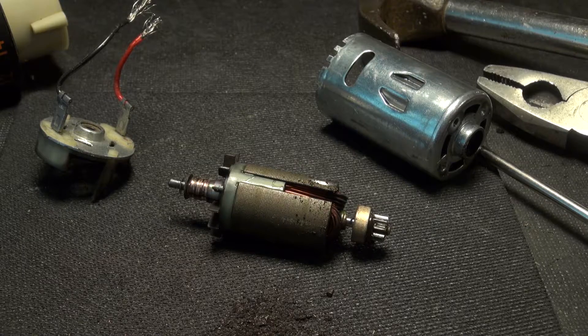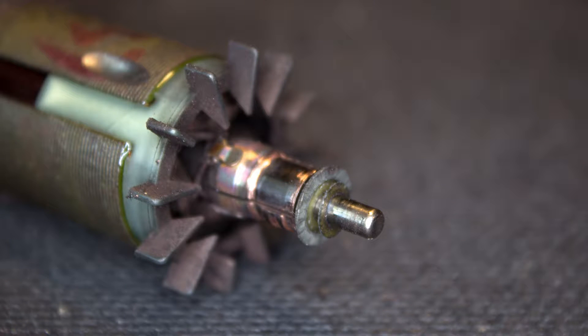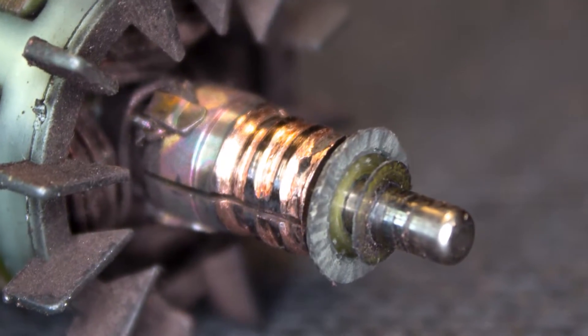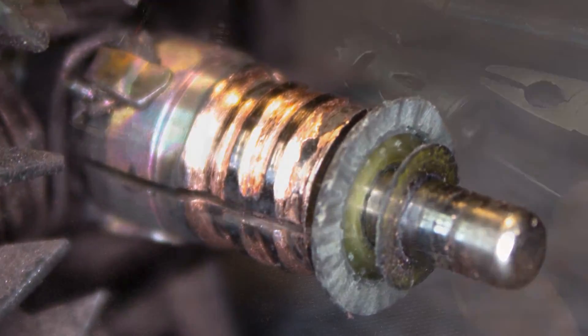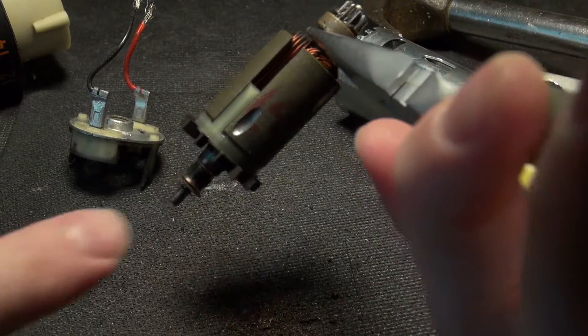Hard to get two brushes — that's a definite negative. The commutator has definitely seen better days; it is pretty gross looking and really worn out, especially on one half side which looks pretty shot. The fan at least — I'd say that's probably metal with balancing marks, pretty deep, one in the back and one in the front.